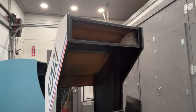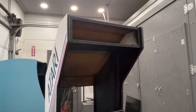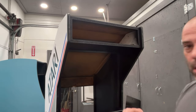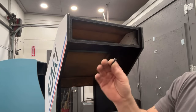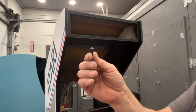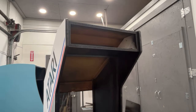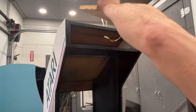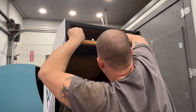We're going to slide the speaker board up there, and these are the two Phillips screws that hold it in place. I'm going to have to go grab a bulb and one more screw because we are short one of these Allen head screws that hold the marquee brackets on. I remember there were only two of the three in the back of the dashboard, so we're missing one. I'm fairly confident I have these in the house, so I have to go grab a new light bulb and another one of these bolts. This just goes right back up in here — I cleaned it up.